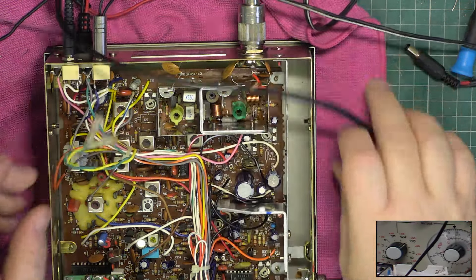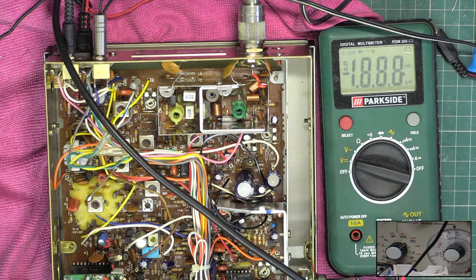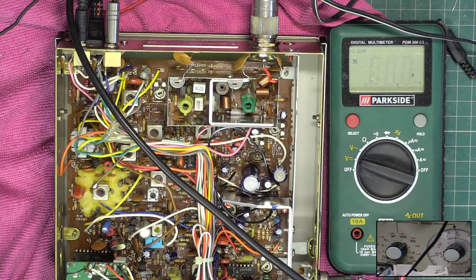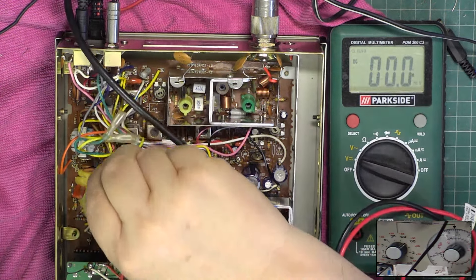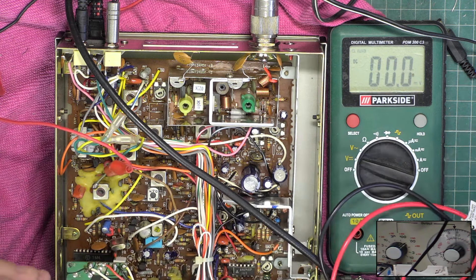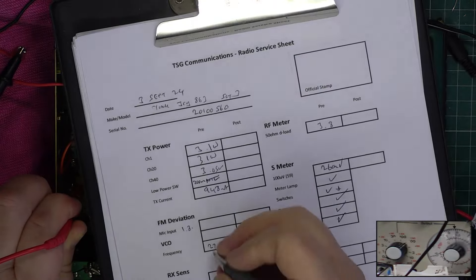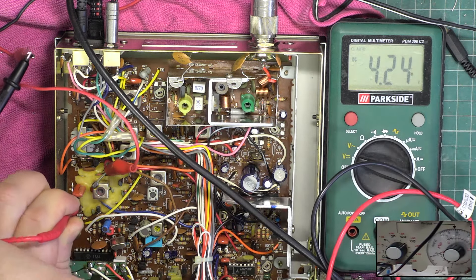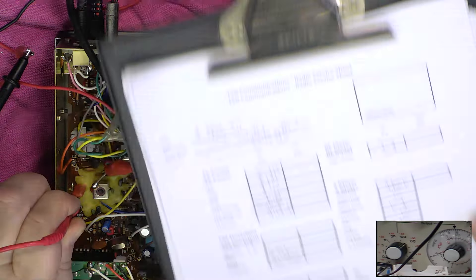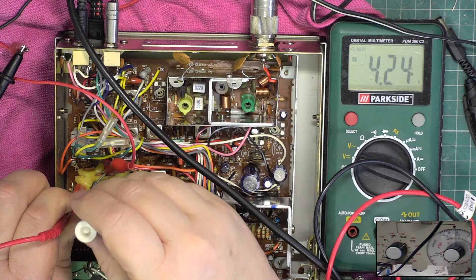Making sure that's dressed properly — no sharp bits. Channel 40 on the radio. So that earth strap — sometimes that's not fitted so we'll clip it to a coil; sometimes we'll even fit the missing strap. 4.25 on receive — let's see what it is on transmit. Oh dear, that's not good: 2.6. So this one's neither here nor there.